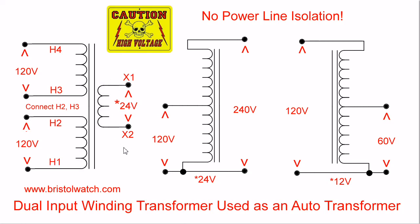First thing I did was wire the transformer for 240-volt input, but instead, from the center tap to H1, I input 120 volts. The output from H1 to H4 is now 240 volts. This is what is called an auto-transformer. Your primary is from here to here, where you put in the 120 volts; your secondary is from this point to this point. In the world of magnetics and physics, half of the secondary is also the primary. This depends on how you wind the windings in the transformer, which is why you have to pay attention to these markings.